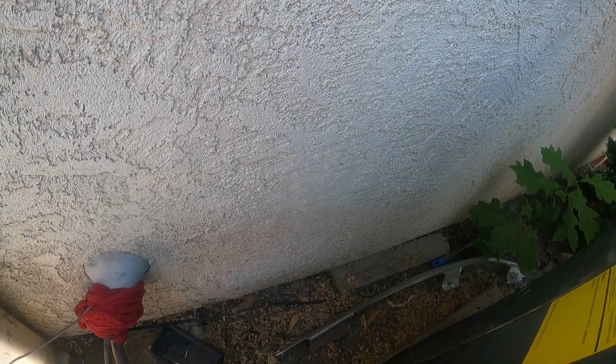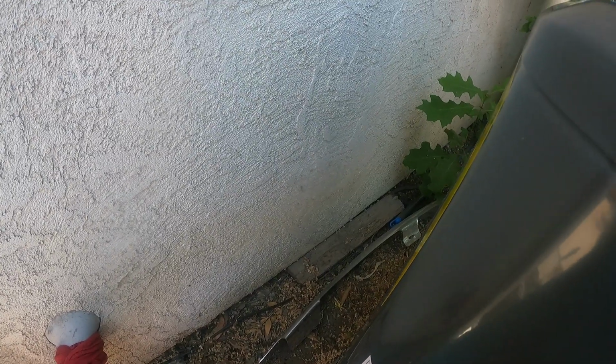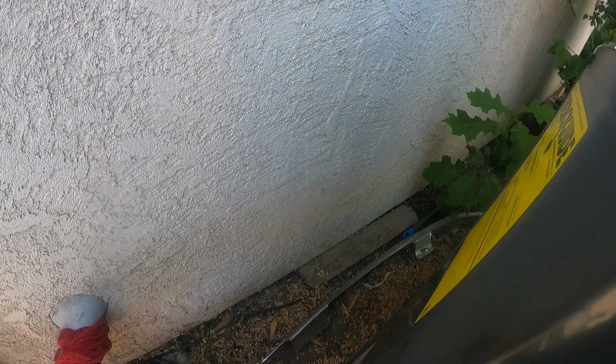And now I'm protecting these king valves here from overheating so that we don't accidentally release all the freon while we're trying to braze, and you warp the king valve. You may not even be able to get it open after you do your brazing if you warp it, or you could create a leak where the freon starts shooting out on you before you're finished brazing.